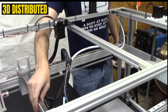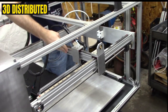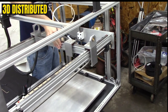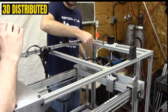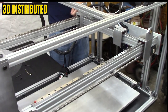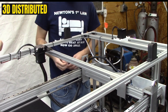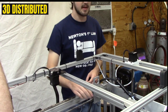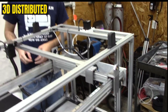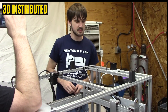Once you're done you can give it a simple test by pushing the carriage down the rails. If there are any tight spots, that's a good place to loosen some screws and let the rails move around, then move the carriage over them. If there's a tight spot on a particular section of your x-axis carriage, it's a good bet that it's an issue with the rails being too far apart or too close together, pressing on the bearing chases in the slides.